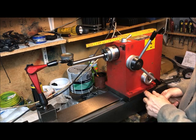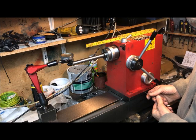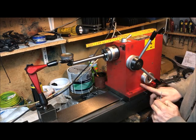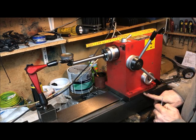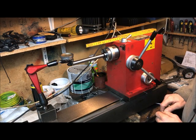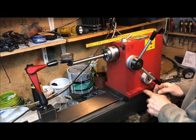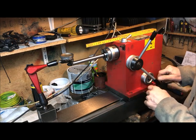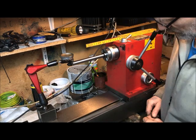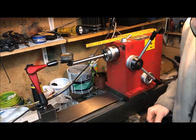So the head is located on these two taper pins, which I'm not sure can be adjusted. They are permanently fixed to the head it seems, and then just crudely machined into matching holes down here. So hopefully this can be adjusted. Otherwise I have to either take off that pin and just lock it through the screws, or actually scrape up this side - which I don't really like because that's the foundation. I like to have the base in order.